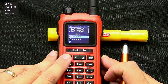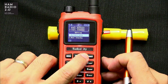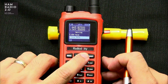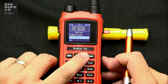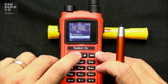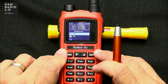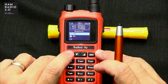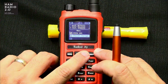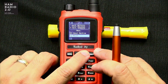Going into the menus: radio set, vox level, battery save, dual standby — you can turn that off and on — SOS mode, backlight timer, and an 'about machine' section which is just your firmware versions. There's a Bluetooth setting — by default Bluetooth was turned off, so I had to go in and turn it on to make it readable by the app. You can set CTCSS, channel storage, save channels to memory, search frequencies, and factory reset the radio.